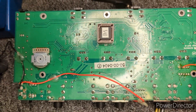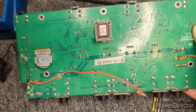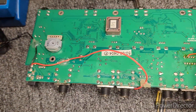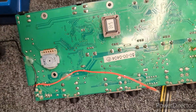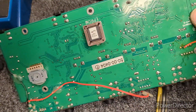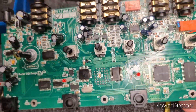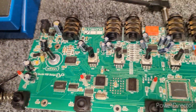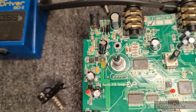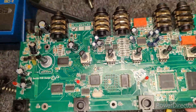I would not try to remove one of these the way I've seen some people do it on YouTube. You might not get so lucky. So if you are going to try that, use that tool — you'll have much better luck. Or if you can solder, try replacing the socket itself, which I might give a try on the other board I'm working on. On that other one, everything looks great — all the clock frequencies measure fine, the input and output stages are testing fine, all the capacitors are good, the power supply section is fine. So it might be something like that with the other DL4 I'm working on.